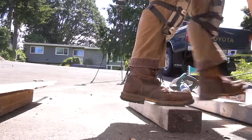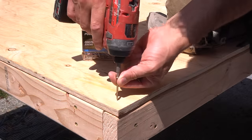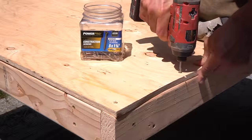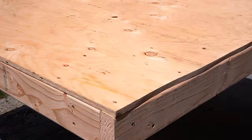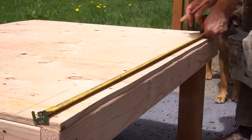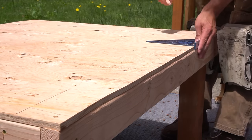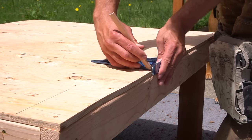For all the sheathing purposes needed for this project, we will be using half-inch plywood, and I secured this piece of paneling to our base structure. Once fully secured, it's time to start our layout process for our walls. This is a small structure, so the layout process is actually quite easy, but just keep in mind that your studs should be no more than 16 inches on center.